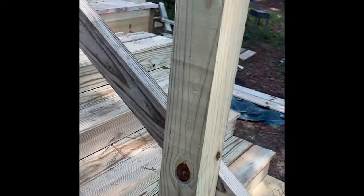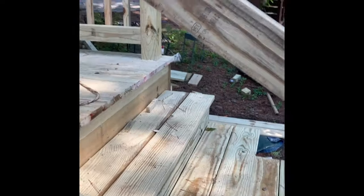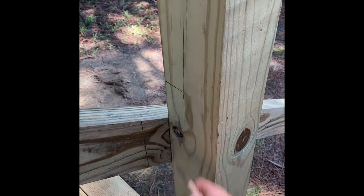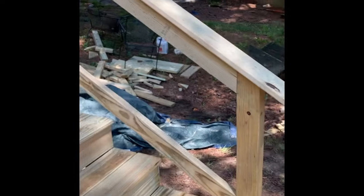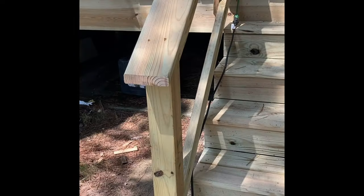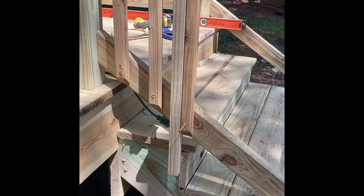To get my height here, I usually just put it at 36 inches — handrails are typically 36 to 40 inches from the deck height to the top. You can see my mark where the top is going to be, so I put it an inch lower for the deck board on top. Cut it off with my skill saw and the Sawzall, and now I've got the rail ready for spindles — same thing using my spacer. And that's how I do it, and that's how you can do it. Be blessed.